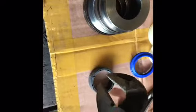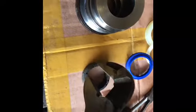And then your wiper seal here. Of course, you want to put this in just like this, with this part right here pointed down towards the barrel. You put that in. And then on the inside, on the other side, you're going to put these 2 in, which are hard to put in. So what I do is I take it, and I grab these grips right here, and I stick one part inside the other where it's split, and then kind of hold it, and put it in like that and push it into place. And do the same thing with the other one.